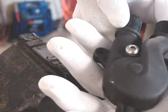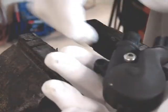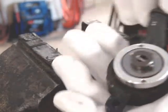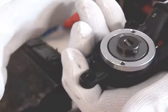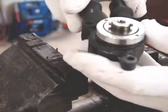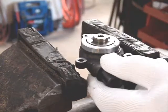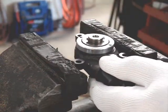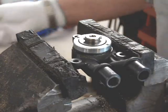The new style water pump, starting in 2015, has an Allen screw for a drain. The old one, the drain was a bronze bushing in the center. I call this a cassette type because you just change out an interior in one unit that's considered not repairable. You have your external housing which is threaded, and then you have the silver looking part there — that's the cassette piece that goes in.